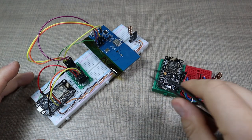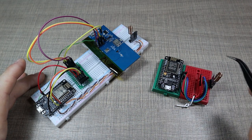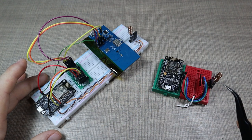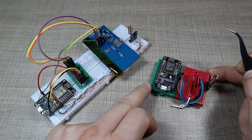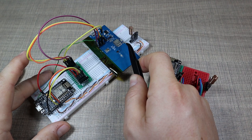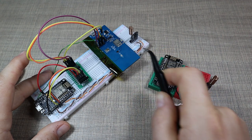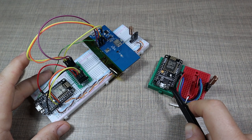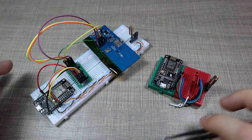In the previous setup we had the two LoRa boards talking to each other, with this one connected via an OTG adapter to the phone — when it sent a message it was received back on the phone. Now, this one is the device that connects with the phone, and this other one just talks to the GPS to acquire a signal, acquire the position, and translates it back to latitude and longitude. It then sends that latitude and longitude over to the other module, which is connected to the phone. The phone reads that data through serial to display it on the map.